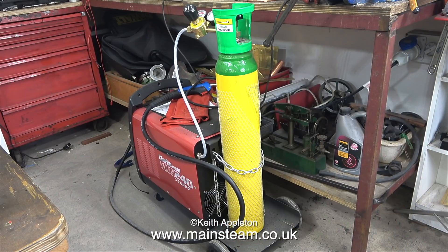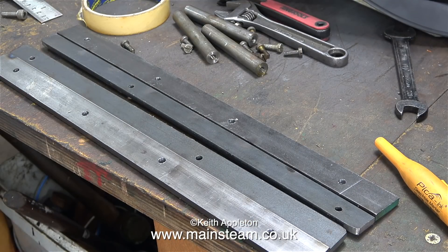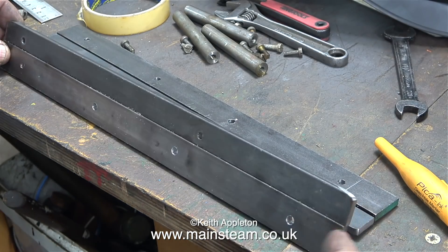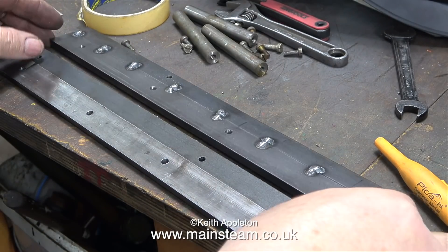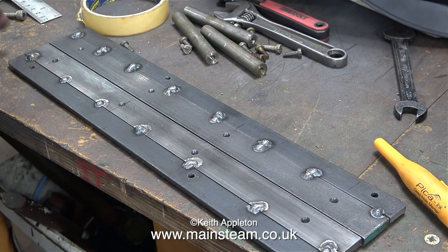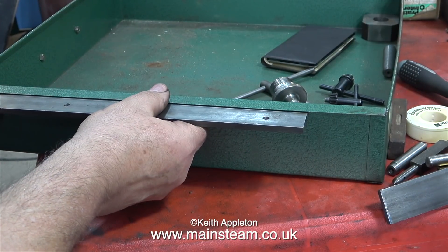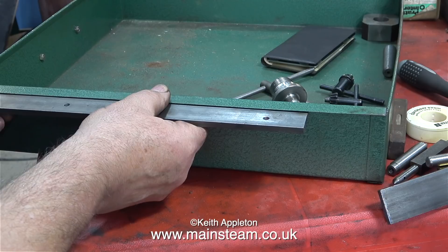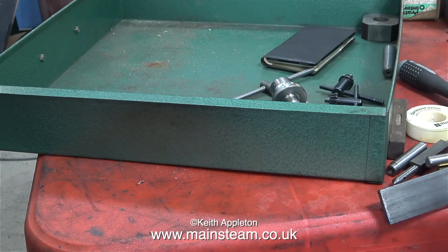I fabricated a pair of runners using four pieces of steel. Two of the pieces of steel are slightly thinner than the others, which forms a channel into which the drawer can slide. Professional welders and armchair welders, please look away now — I've fastened the two pieces of steel bar together just by using a series of tack welds, and this will be more than strong enough for the job. All I have to do now is screw these up underneath the underside of the worktop on which the Myford is sat, and the drawer will slide in and out easily, I hope.